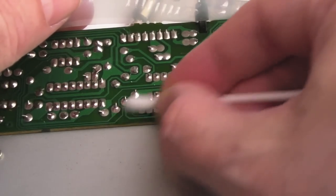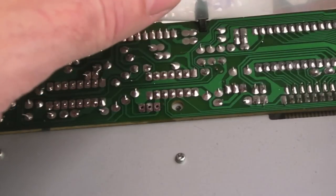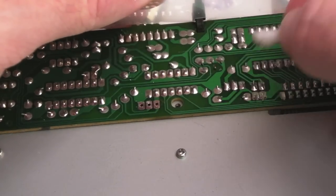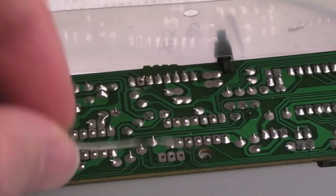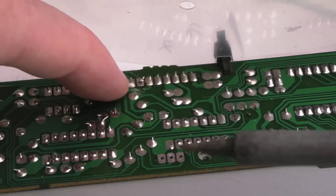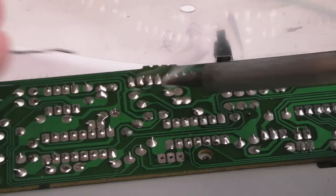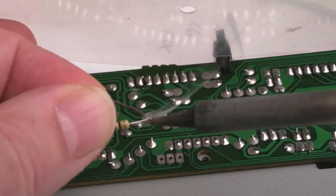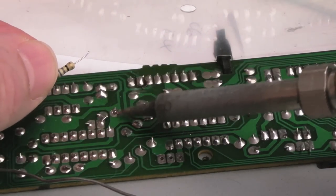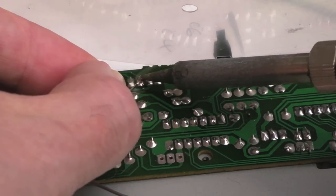I need to clean around that transistor to the right there as well — I went to desolder the wrong one initially, spotted it before I took it off. I've worked out the connections: the one on the left of the ribbon connector is the floppy drive LED, the one to its right is the power LED. I'm going to put some solder on there and tin up the end of this resistor — I'm putting it in between here where the VCC rail is that goes to the 74 chip.